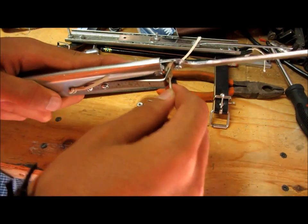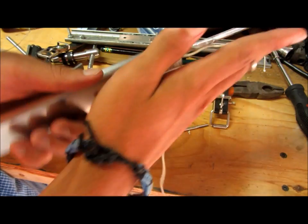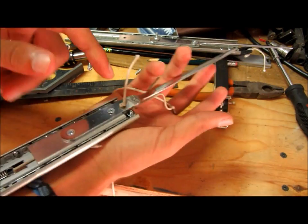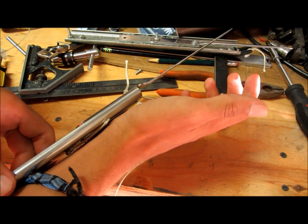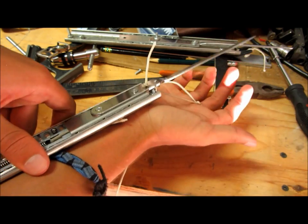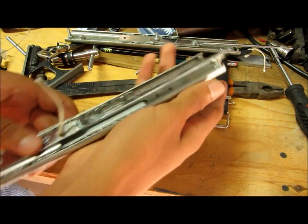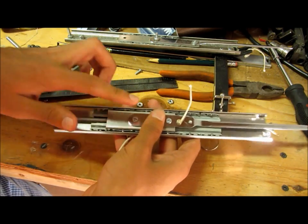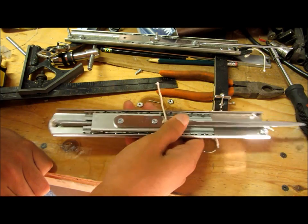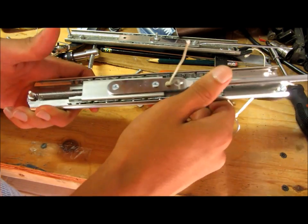See that it didn't go all the way. If it gets stuck right here or there, all you need to do is take this inner slide and just compress it a little more so it rolls along a little easier. Or you can shorten up your spring and make it even more taut. So that's that. The last thing you have to do is take a string, tie it right here, and then make a loop for your finger. So that when you mount it and take the blade out, all you have to do to make it go back in is pull on your finger. So if you take the string, tie it to the ruler right there and then make a loop in it — or tie it to a key chain, which is what I do. Just put that loop on your finger. I like to put it on my middle finger — it doesn't really matter. Fully extend this, and if you pull on whatever finger is on the loop just a little bit, it should go back in just like this. As you can see, it goes all the way in. If it doesn't go all the way in, tighten that up, compress it, or maybe take some balls out so there's less friction. If none of that works, you can always switch the spring — maybe use a stronger one or shorten it up.